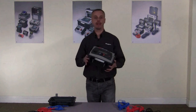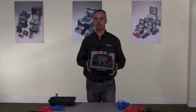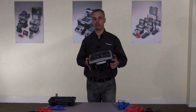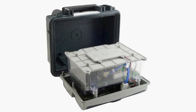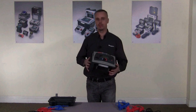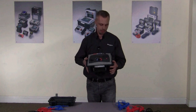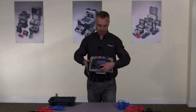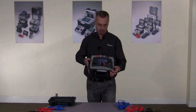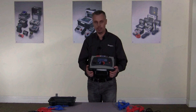It's small and lightweight, making it easy to carry and easy to store. It's also fitted with lithium-ion battery technology, which means it can be charged in two hours flat. It's tough, with dual case construction: the inner case gives you fire retardancy and protection, while the outer case gives you toughness and the ability to take the knocks and impacts of everyday life. It's also noise-immune, with a full 3 milliamp of noise immunity, making it ideal for substation environments. There's a voltage measuring range which can measure up to 660 volts and also measure frequency. We have full data storage and download via USB, and all test results are date and time stamped.